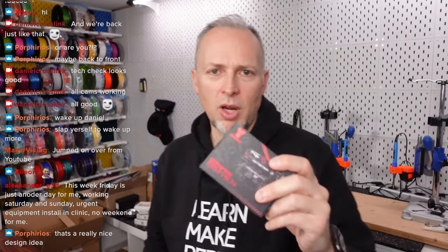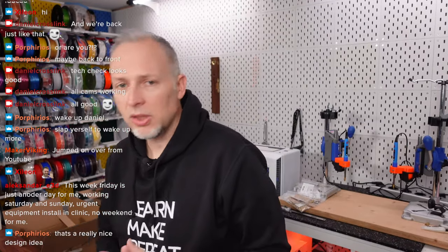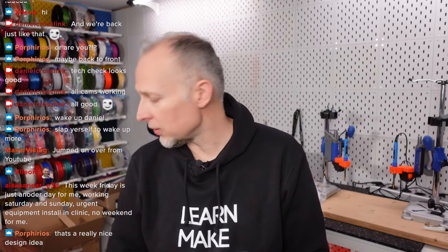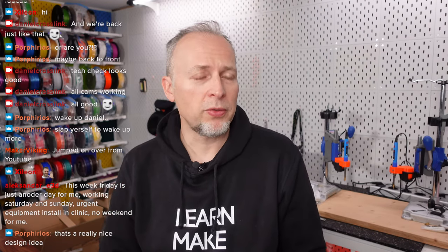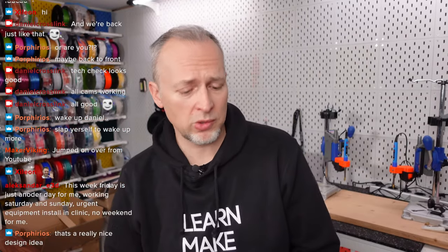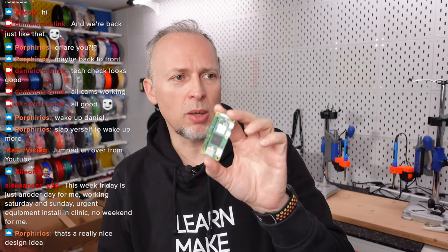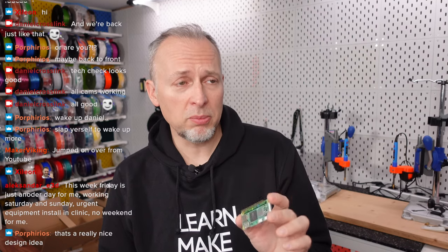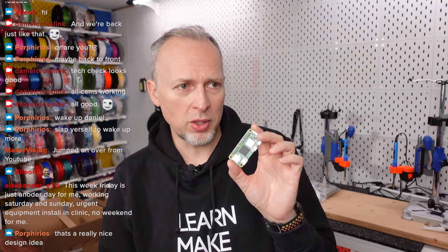That's only the drivers. But we also need either a Raspberry Pi or a BigTreeTech Pi. Different things are here as options. I have Raspberry Pi 3, 4, and 5, and also the BigTreeTech Pi 1.2. So we can basically make that decision. My best guess is that since the recommendation for the Voron Zero is that we could theoretically just use a Pi W or 2W, more precisely a 2W, which is effectively a Raspberry Pi 3B plus with fewer ports.